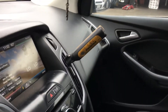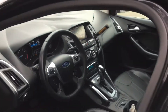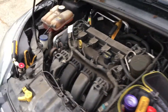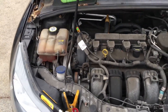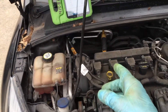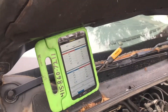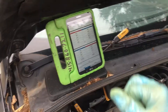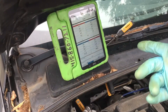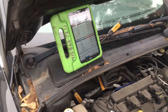There's your Bluetooth sensor taking your dash temperature. Remember, that's a 12-inch probe, so it's taking the temperature deep down in the duct, not at the surface. Infrared IR guns are not reliable for taking temperatures — don't use them. There is a way to use them, but you have to understand how to use them correctly, otherwise you'll get some really cold readings that are not real. That's a topic for another video — I've done a video in the past showing IR guns taking totally false temperature readings out of ducts.